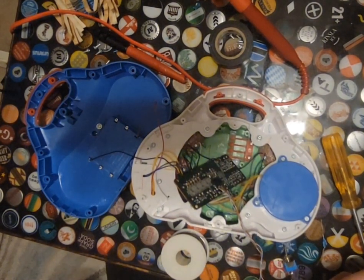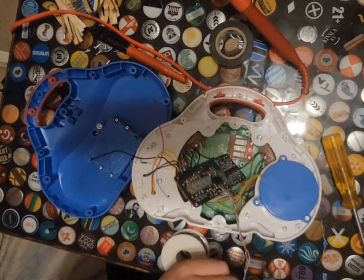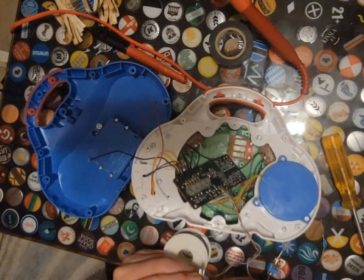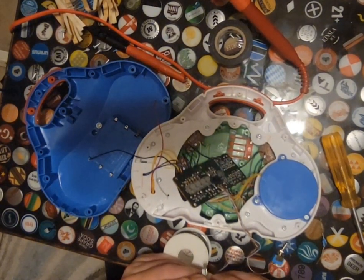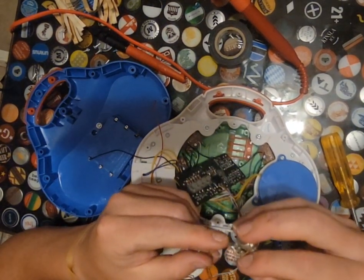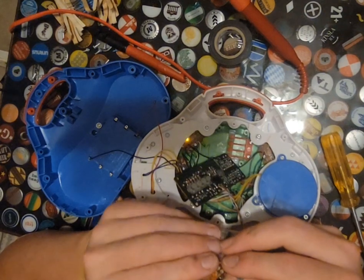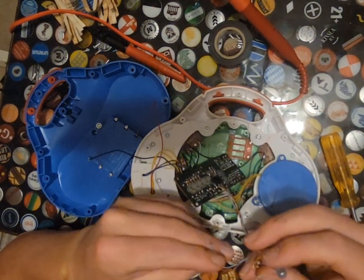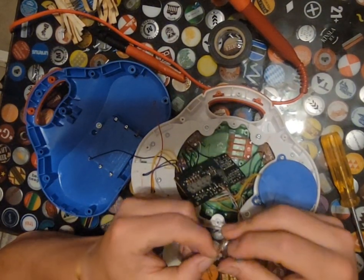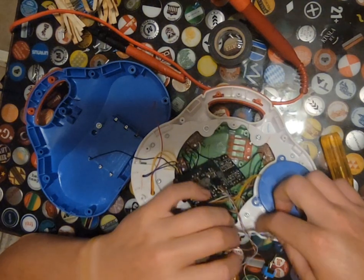So that's a complete stop and is not crashing it. So that's what we're going to go with. Potentially what could happen here is we could get down to the bottom and this could be a little much. What I mean by that is it could overpower the potentiometer where it's pretty much low all the way around except for the end point, which would of course revert it to completely high. Not a big deal, but I don't personally like when that happens, so we may end up limiting both of them. We're just going to have to see how this turns out. And we may be desoldering these and re-adding them, but we'll see.